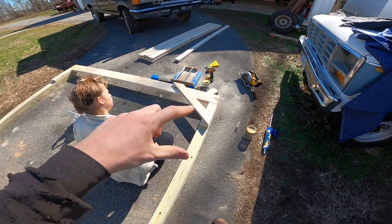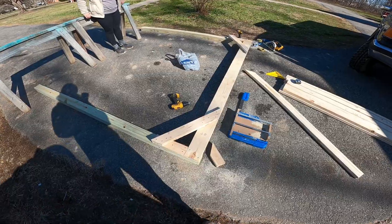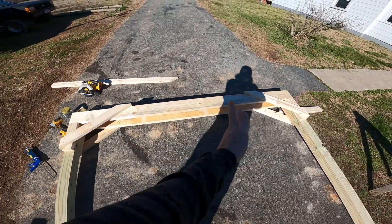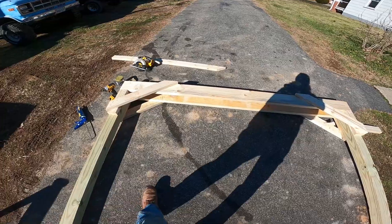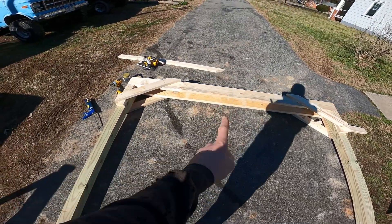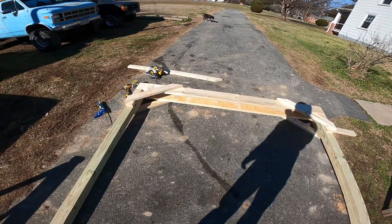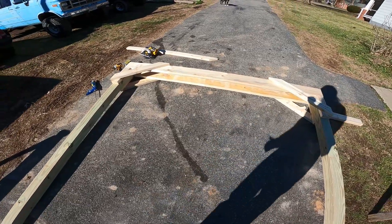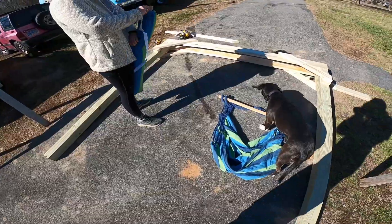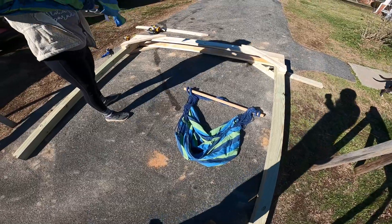No more walking. Now with it starting to look like something, flip it over and do the exact same on the other side. Now that the top is a mirror of itself, I'm going to run some supports in between the 2x6s to tie everything together. My winch is going to sit on top and the cable is going to come down in the middle. The battery will need to sit on the corner somewhere or up top. We'll definitely have to use a ladder to hook it up — but you hook it up, use it, and just take it back down. This will be a multi-purpose gantry; the supports are going to have eye holes for hammock chairs for when it's not being used to crane stuff.